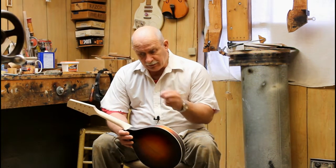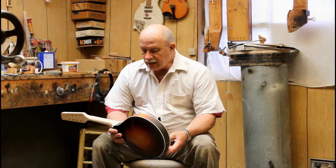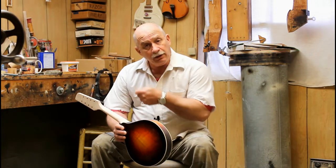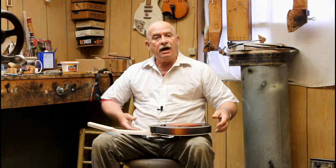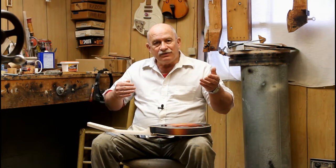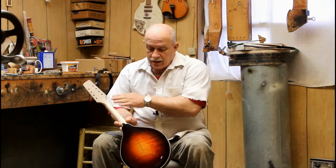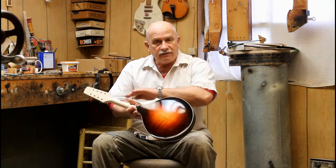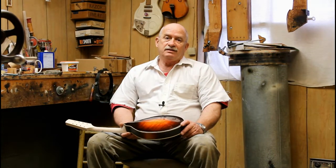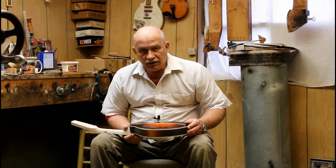I'm going to try to age the binding with a little bit of yellow stain. I'm not going to tape up the sides — I'm going to leave those exposed. At some point during the clear coating process I'm just going to pull a couple of clear coats all the way around so that when the time comes to polish it out we won't have any of those nasty little feather lines where you lay a new coat of lacquer on top of an old coat and they don't melt together, leaving a little feather line when you polish them out.